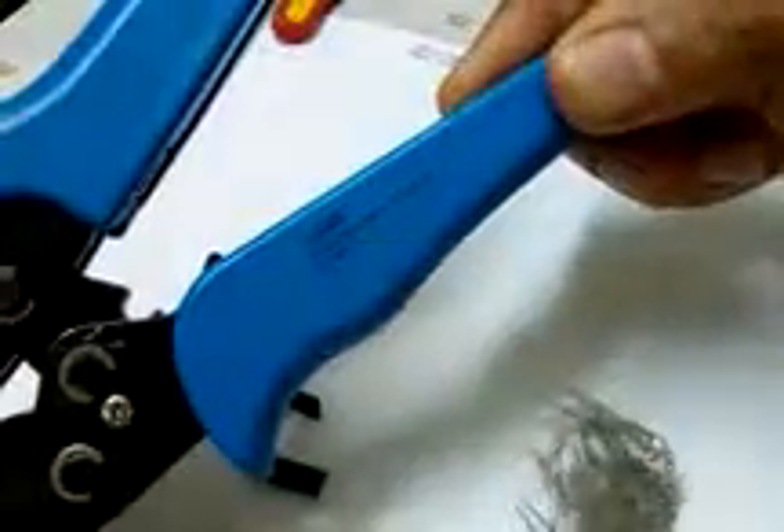Today let's see how we can crimp wire onto crimp connectors. What I have here are male crimp connectors and something called crimp housing. There are varieties of crimp housing — 1-bit, 2-bit, 3-bit, 4-bit — all with a 2.54mm pitch width. To crimp a wire you need a crimping tool; this is a crimping tool of SN28b model, which can crimp connectors of 0.25mm², 0.5mm², and 1mm² sizes.